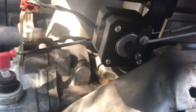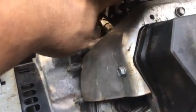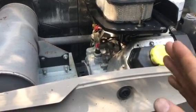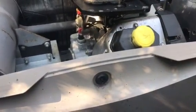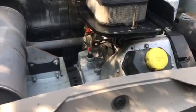You can't tell, but the linkage is wiggling while the stud into the governor is not moving. There's an Allen screw right here, and as I wiggle this I can turn it almost a quarter turn before the actual governor reacts. So the problem with this one is it's getting its signal to move, and the linkage having so much slack in it is just slapping back and forth, which is causing the violent hunting. There is an Allen screw here that we can tighten up.